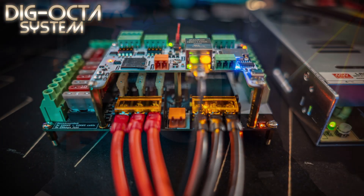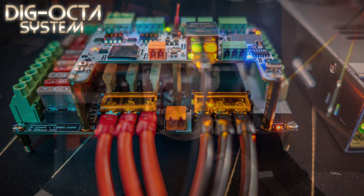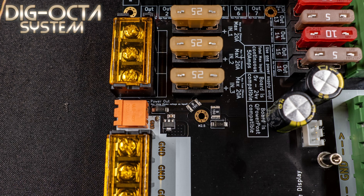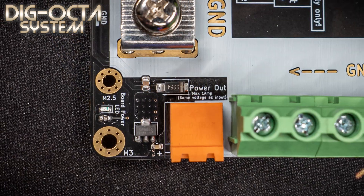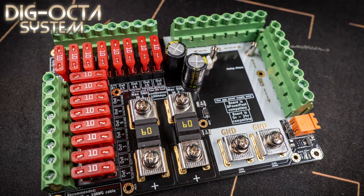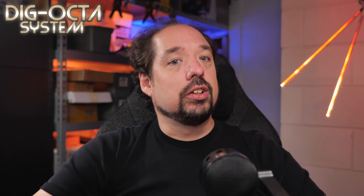All current power boards also support the Q power post system, allowing them to feed power to the brain boards in your stack even if mixed voltages are present. The power boards also have a special orange connector which can be used in the case of not using Q power post to power a brain board. These outputs have an automatic fuse and are current limited with back feed protection in place. To make sure power is as stable as it can be, the power boards each have two big bulk capacitors on the board, plus a 1 µF capacitor per output, allowing for quick responses to varying loads and soaking up transients LEDs can generate. Each port also has rudimentary reverse polarity protection built-in, which will try to kill the fuse before it kills your equipment.